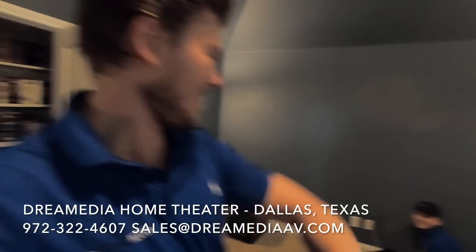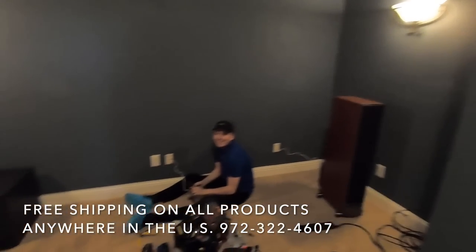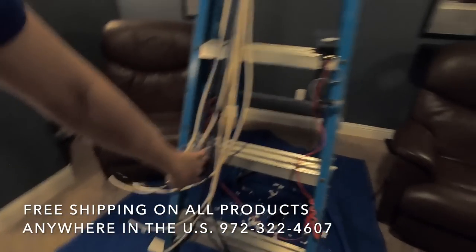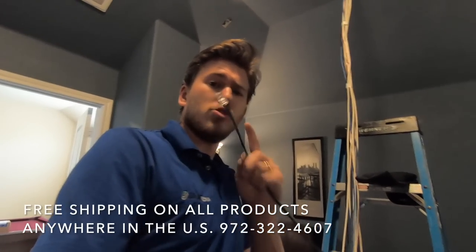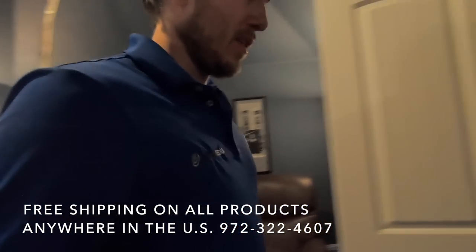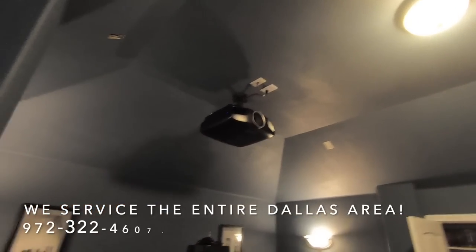Check it out guys, we are moving right along. You can see we got all that ripped out and Grayson's getting everything connected up here. We got the customer's tower in the pre-wired location, hooked up to the home's wiring. Grayson is working on the center speaker right now. The customer actually didn't have a smurf tube in the ceiling - that's something you should look into when building. Make sure they put in a smurf tube, because if not we have to convert the Cat5 cable over to HDMI using a balun, and baluns are not cheap.